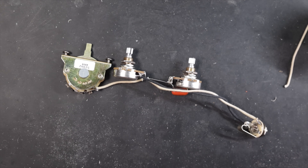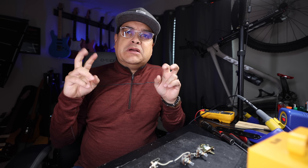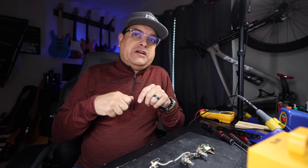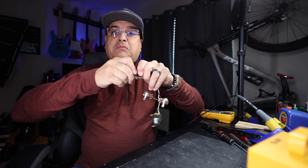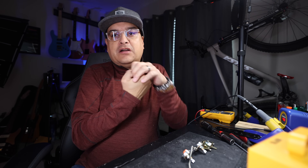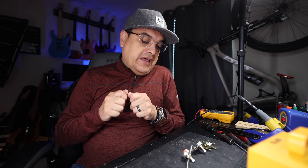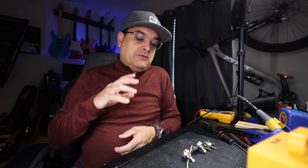There is a ready-to-go drop-in wiring harness for a Telecaster. Tip number four: don't worry about all of the stupid myths on the internet when it comes to soldering. People are going to say you didn't make a mechanical bond — put the thing in, bend the wire around, all that. I could pull this right here as much as I want and this is not going to come off, because when we solder correctly the solder joint is very, very strong. We don't need to hook the wire around — that makes it very unserviceable. The more time you have to spend with the soldering iron on a component, the more likely you are to damage it. Just put the wire in; if the solder joint is good, we're fine. We don't have people hanging on our solder joints here — this is not welding, we're not holding up bridges.